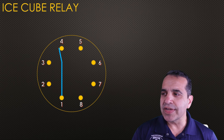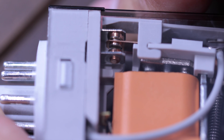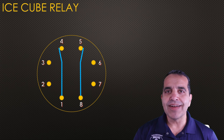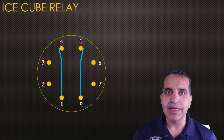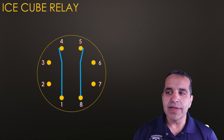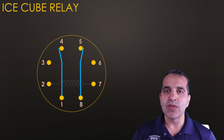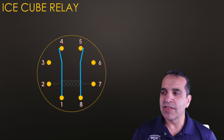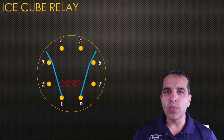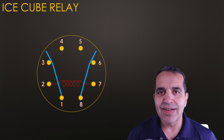Pins one and four are normally closed together. There's an arm, and there are actually two bars — one between one and four, and another one between eight and five — and those contacts are normally closed. That means if the relay has no power going to it, one and four are closed, and eight and five are closed. There is also an inductive coil inside the relay, and when you apply power to the coil, the arms in the relay will change state.